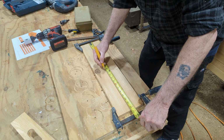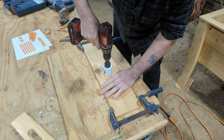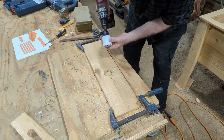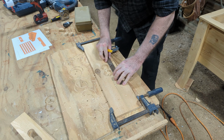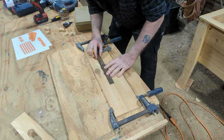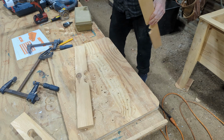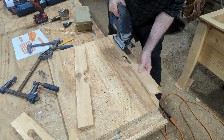Next up are the tray notches on the crate sides. This process is similar to the handle openings but are a different size, 4 inches long by 1 inch deep. Clamp the side pieces together and lay out the notches in the center top of the side pieces. Use a 2-inch diameter hole saw bit to cut out the radius portions of the tray notches. Draw a line to connect the bottoms of the curves and cut along the lines with a jigsaw.